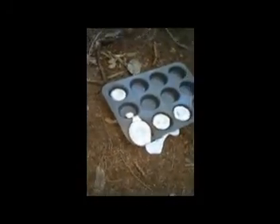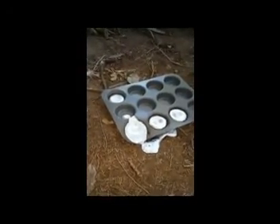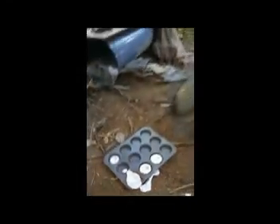Here's the aftermath. You can see my crucible — I got a fair amount of dross. I also accidentally dropped a couple of charcoal briquettes inside while filling it up, so I got those out at the end. You can see the embers are still burning. This was my first ingot pour — I got a little overzealous and poured way too much, and it splooshed out around the side, but we got two and a half other good ingots. Pretty happy with that for a first pour.